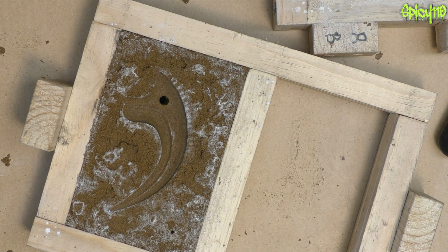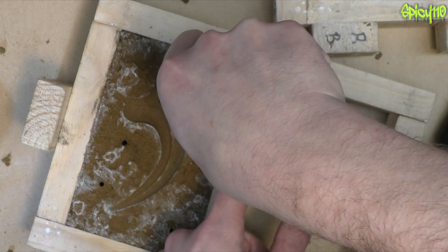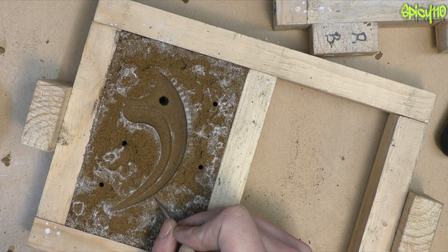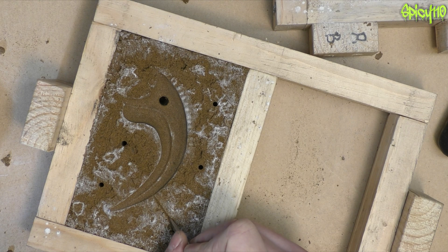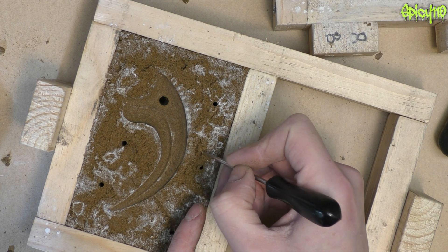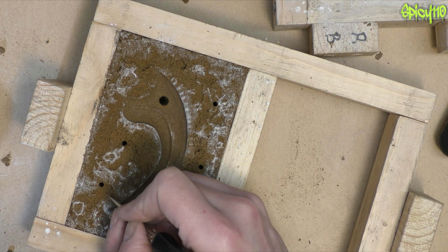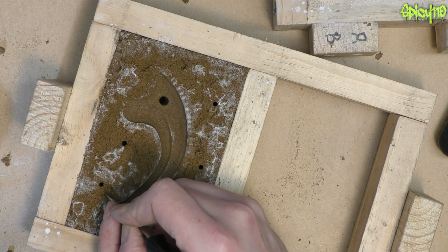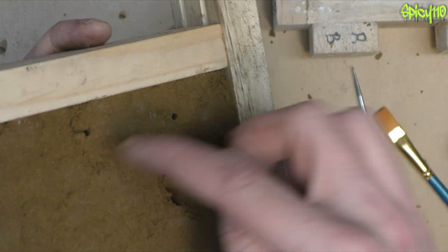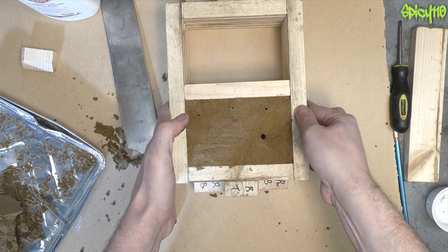Oh no, don't get that grease off of that. I know this is a terrible, terrible mold and this is probably going to completely fail, and the flashing is going to be horrible, but I'm this far in, so why don't we just find out? I've created a little well and a hole that goes down — that's the pouring hole. The vent holes come up and allow the air to go out as the metal goes in.